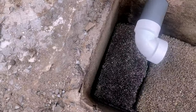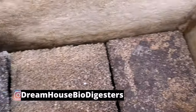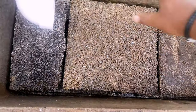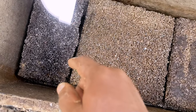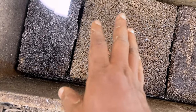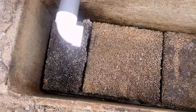If you come from the side, make sure it comes all the way to the mother pipe — from here, or from here, or from here. Always make sure it's centered around the mother so that the human waste can spread evenly. This also shows that those who put a basket inside — that's why it does not last. That's one of the reasons why we don't put baskets in the digesters; we prefer the human waste to spread evenly across all the levels.